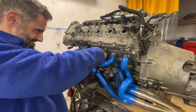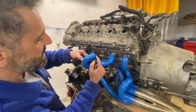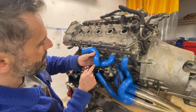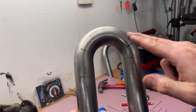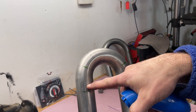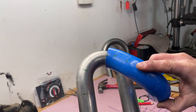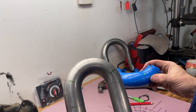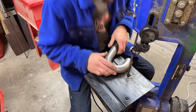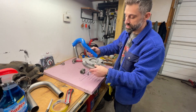Starting with the first subsection — this is actually three pieces: a 2-inch bend and a straight, then two, two, two, two, and then it turns because the arrows are no longer lining up, then a two and a two. I identified that the first two sections — a curve and a straight — require two cuts, and the next section is four 2-inch bends requiring another cut. I need to go to a whole other piece to make the remaining two bends, which adds another two cuts. There ended up being six straights, which are six-inch straights by definition.